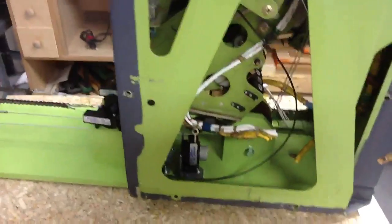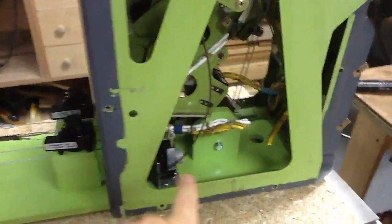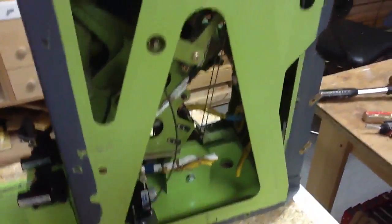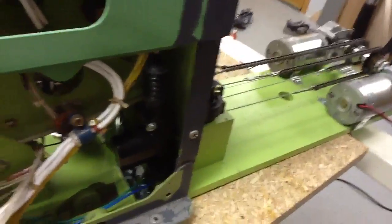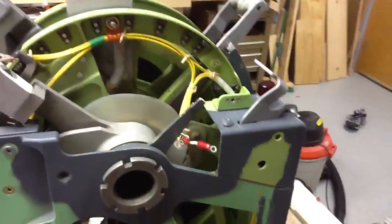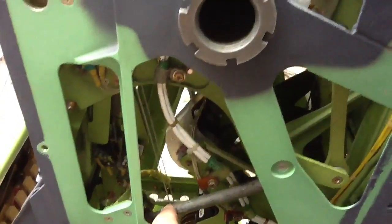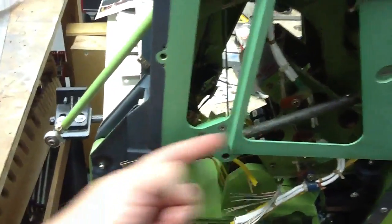You can see where I put another string pot here, and there's a cable that's kind of looping out — that cable is for the flap lever, which will just come down and be strung off this little string pot going up and down. I have the parking brake I'm working on up here — one of Rob's designs using a little car door lock actuator, which will pull the parking brake back down when you tap the brakes. And then I'll be working on the trim indicators next, which come down to a jack screw mechanism. I'll be pulling out the jack screw, putting a hole through here, and putting a servo out here to actuate that.